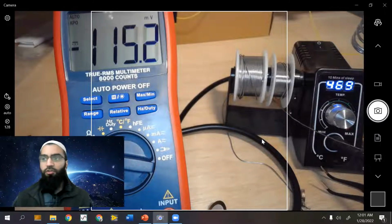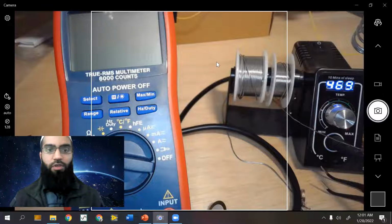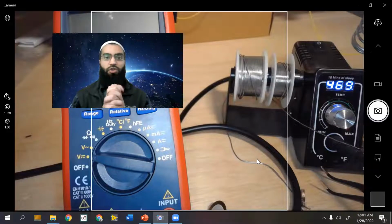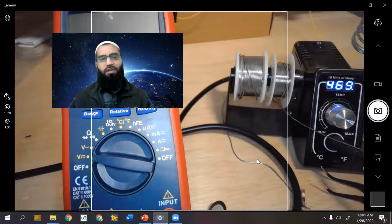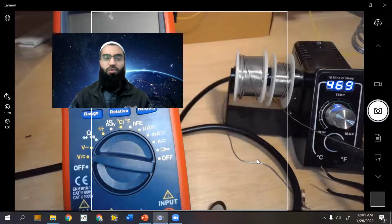The reason why heating a ceramic, oh, there you go, that went off. So the reason why heating a piezo ceramic is going to create voltage is because that heat creates charge due to the pyroelectric effect. Basically, as you increase your temperature, you're getting closer to the Curie temperature, where polarization is 0. So there's a change in the internal, remnant polarization of the piezo ceramic. That's going to cause a charge to appear on the surfaces in order to balance out the total charge in the system. Similar to what would happen when you pressed it, the polarization of the material changes, therefore charges appear on the top and bottom surfaces in a similar way, but due to different causes, though some similar causes, but mostly you can consider them to be different.